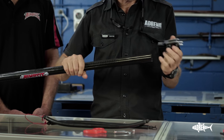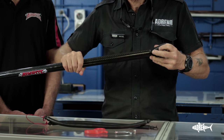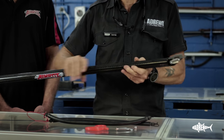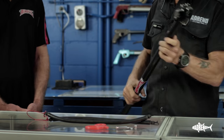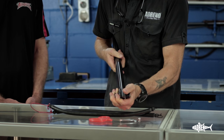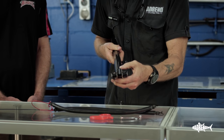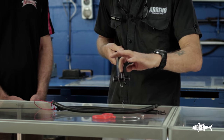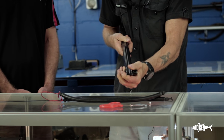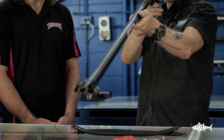The idea is you get it in here and bring it in slightly. Don't force it or bang it — it doesn't need it because the barrel is made for it. The idea is to get it exactly right. You just move it back and forth and you've got a couple of high points that you can judge the muzzle to the barrel, so you move it so that it sits bang in between those. Then you also want to look down it to make sure it's straight, and let the customer have a look too.